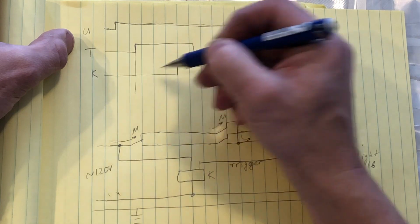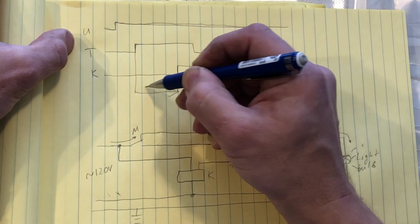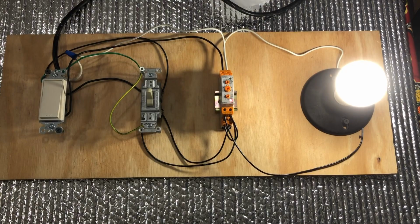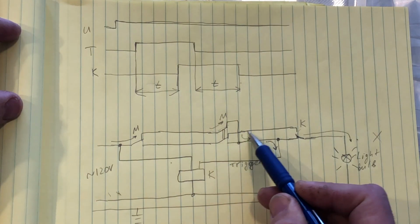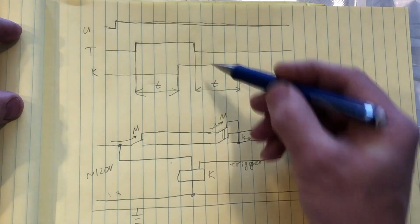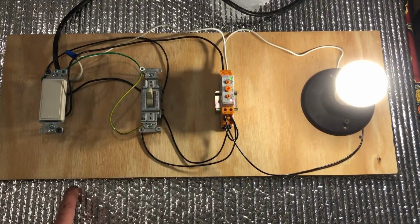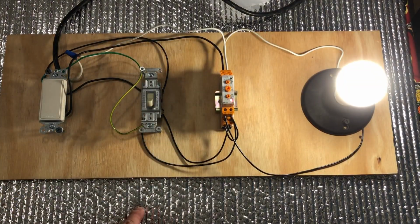When this takes place, the relay's internal timer starts and, upon elapsing, switches the contact, turning off the light bulb. When any of the manual switches are flipped, the trigger gets de-energized, which starts the timer again, and when time is up, the relay's contact switches, and so on and on and on.